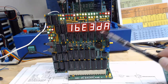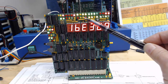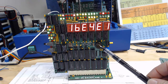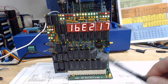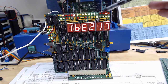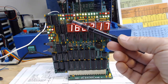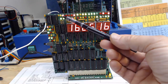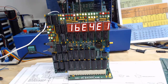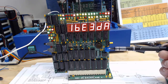The base configuration address lets us configure what type of breakpoint to stop at. Through software we can also replace the manual switch control for filtering the various bus cycle types. In the command register we can also toggle this little speaker to make some noise by outputting a frequency to it. Well that's pretty much the bus monitor tour: binary address values at the top, binary and hexadecimal data display, LEDs for bus filters, status indicators for the board itself, and status indicators for the bus and microprocessor on the left hand side.